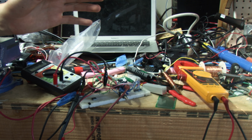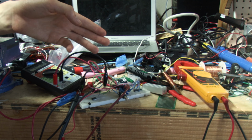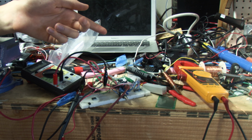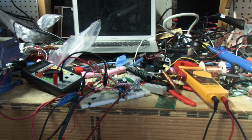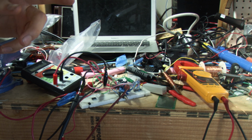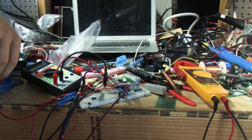I've seen a ton of circuits online that have resistors and capacitors. I'm not using the capacitors, not really an issue with that. I've tried using the resistors. I moved it around so it didn't use them, and it worked fine. I've seen resistors between the output of the op amp and the gate. Could be something to keep the current from going too high. I haven't actually measured the full current on that, but it was seeming to cause issues, or it was something else that's not a good connection.